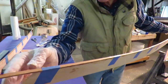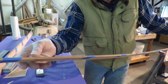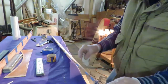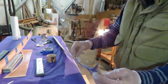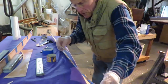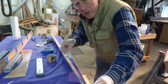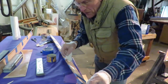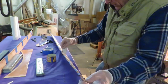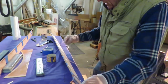The front ends will be cut off after everything's set up, then we'll bevel these ends so the two pieces meet nicely. We'll put them in place as we do that and fit them so the two pieces fit together well. When cleaning with the business card, tip it just a little bit so it doesn't go right into the corner - you'll leave a small fillet there, which is probably a good plan because it'll be a little stronger and ensure you won't end up with a dry joint.